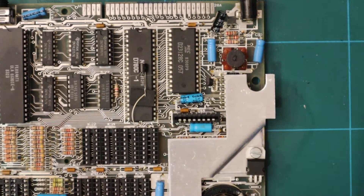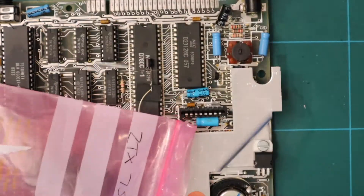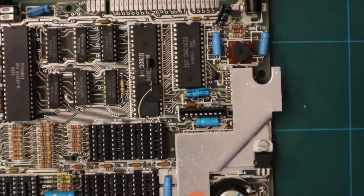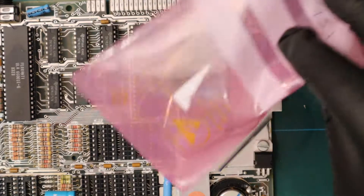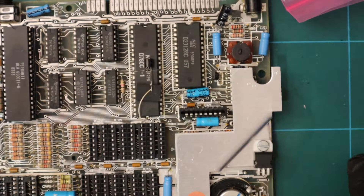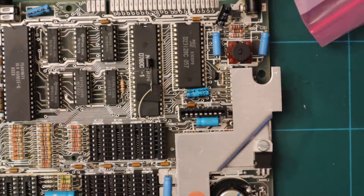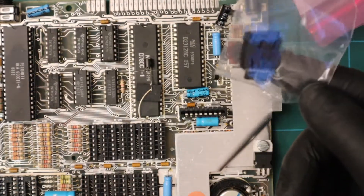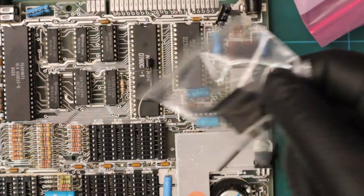We're done with the bottom end of the board. Like I said, I've been shopping - I've bought a new set of caps, a new switch-mode voltage regulator to go in there, and a few other things including a membrane. Today some new transistors arrived. We're going to take out TR4 and TR5 and compare them against the replacements. This one is the ZTX751, which replaces TR5, and these are the ZTX651 transistors, which replace the 650s - I think that's TR4. We're going to compare the old transistors with the new ones to see if they're working.